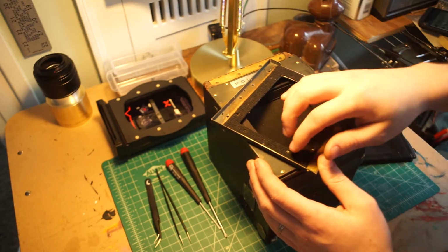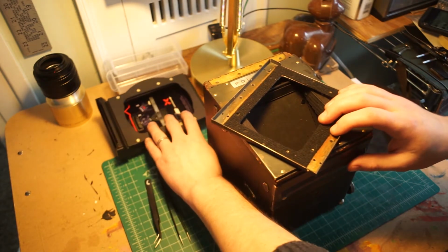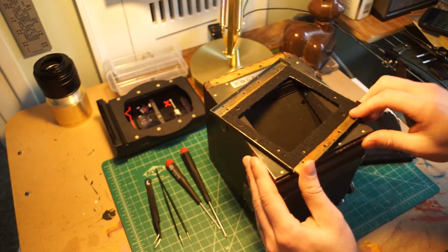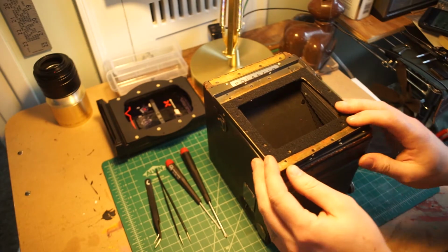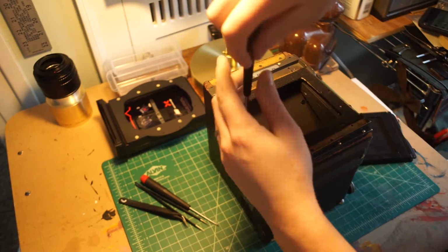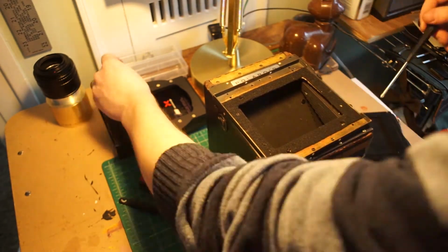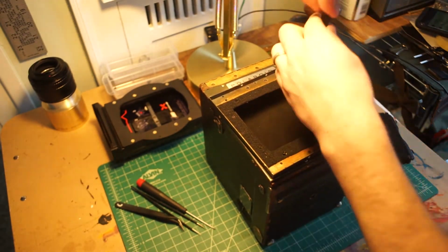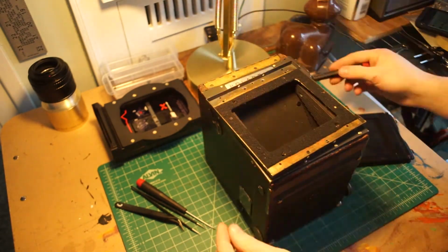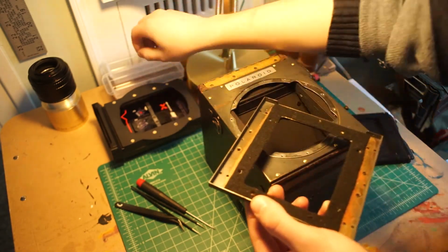You'll notice that there's 14 screws arranged in a circle here. Those screws attach to the rotation ring that will later attach to the CB103 adapter too. To begin with, I'm going to remove the 14 screws, and that will take this first adapter part off, and we'll see the ring underneath. Once we have the back removed, you're going to want to save all your screws so we can use these for the next portion of the adapter.